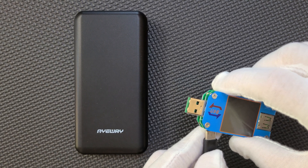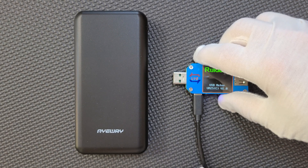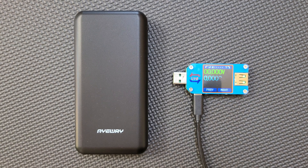The results are in and I have to say that they were a little bit underwhelming. The device tested just 14,156 mAh, and even after we adjust that to account for the fact that we tested at the USB output voltage of 5 volts, whereas the internal cells have a nominal voltage of 3.7 volts, it still gives us an adjusted capacity of just 18,861 mAh.